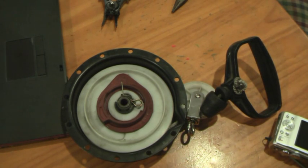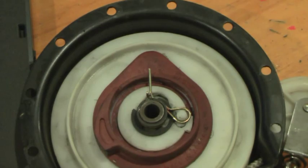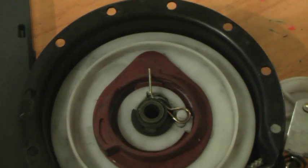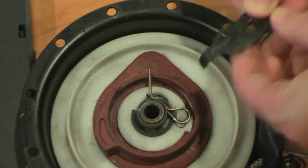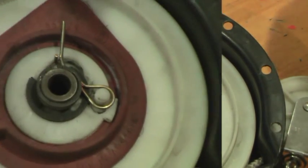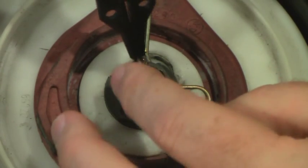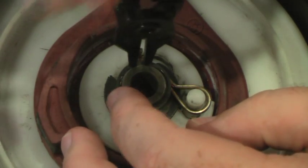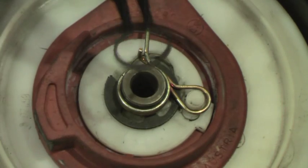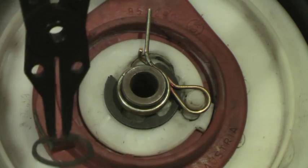Now I'm going to take away the actual mechanism. This thing in the middle is called a circlip, and you get a special pair of pliers called circlip pliers, which work to just separate that mechanism and pull them apart. Using the circlip pliers, push them into the hole and push just to separate them out — just like that — and the ring just comes freely out.